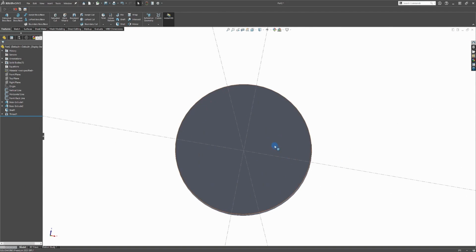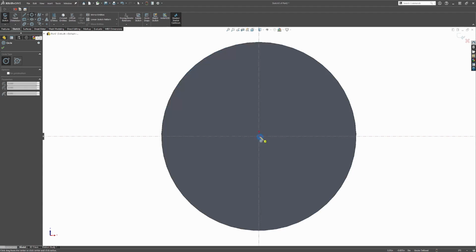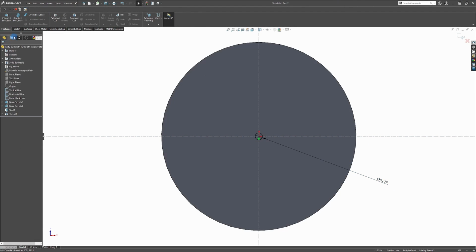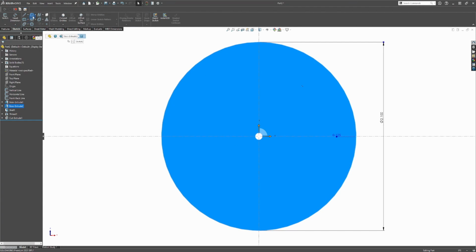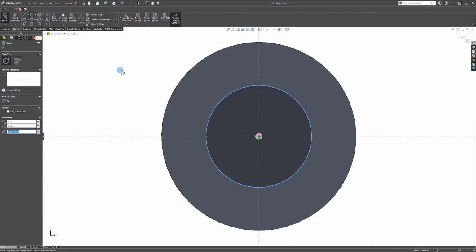Now all we need to do is hollow out this top. So first thing I'm going to do is give this top the opening for our string. This is around 2 millimeters, and I can extrude this. I want to extrude cut and just do through all. And now I want to create some more holes on top, so I'm going to do similar to the other bottom one. Going to create a circle, and I want this to be a construction circle.